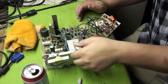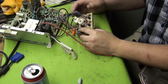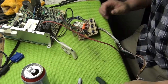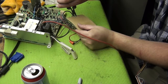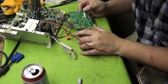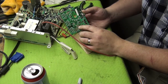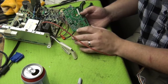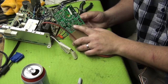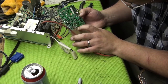Okay, now we've got the monitor on the bench and we can take a better look at it closely. I usually start at the neck and work my way down. I can already see that some of these transistors are kind of loose, and that's not good. We're going to go ahead and cut this back shield off. Yeah, as you can see this one's holding on by a thread. It's lifting the traces and everything, so we're going to have to bodge this one.